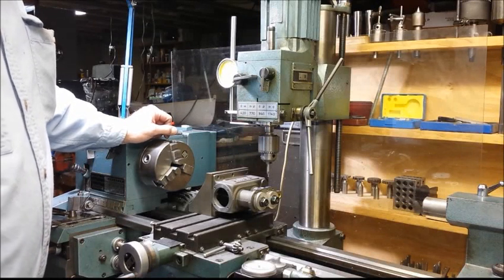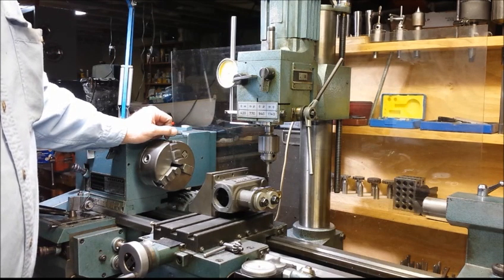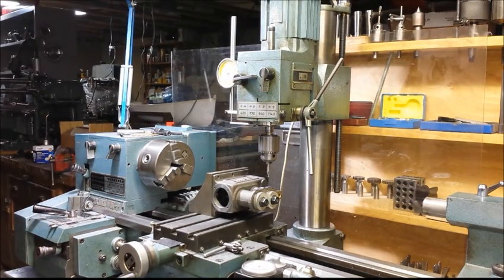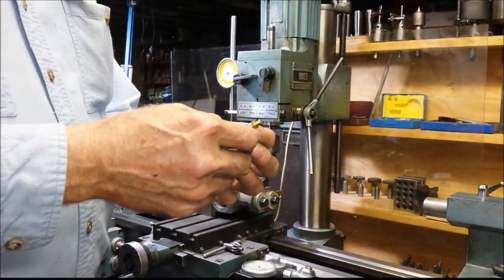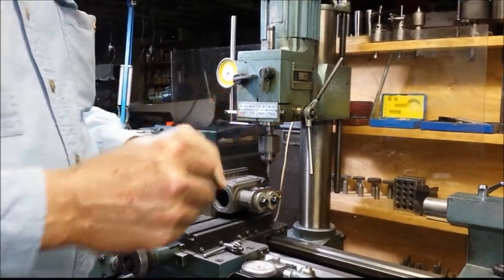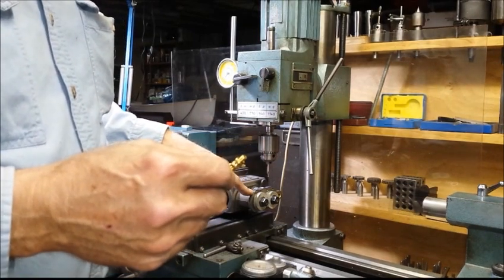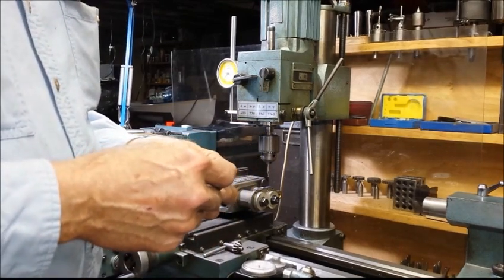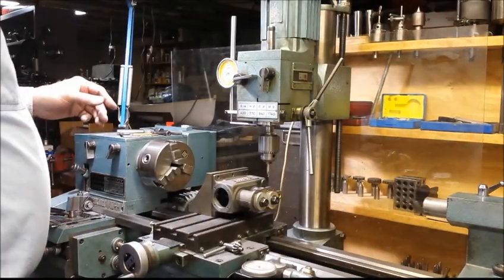Working on the cylinder block. Should have done it when it was set up in the earlier video, but the drain cocks are tapped — threaded 3/16"-40 — and they're pretty long. I can't drill too far for the tapping or I'll drill right into the cylinder, so I'm going to have to be careful on the depth. Let's get started.